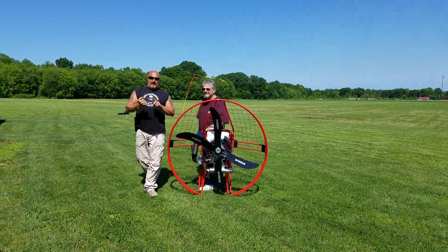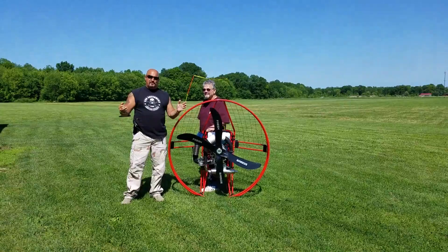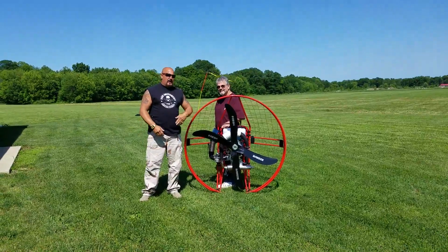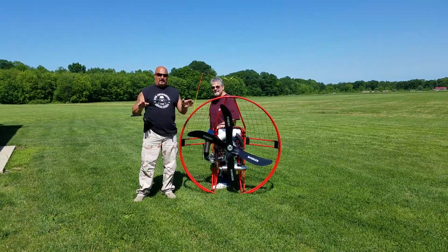That's the advantage of having high energy ignition, a float bowl carburetor for twice the fuel efficiency, and none of the diaphragm carburetor problems, the pumping, the blowing, the priming, getting them flooded, taking the spark plug out. All of that nonsense is gone.